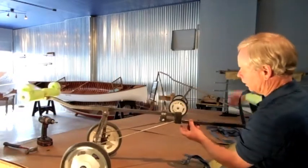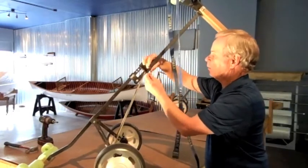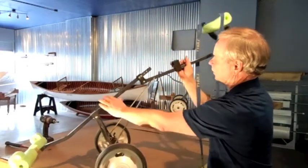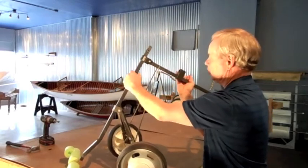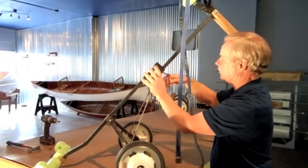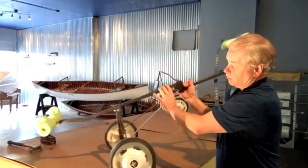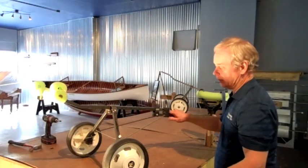Now, these nice carts are collapsible, and to make it so that you can collapse it, this piece moves up and then these will swing down and you have the cart folding up. But you need to be able to keep this piece in place. We've used a simple pin that we bought at a hardware store that will thread through there, and that will hold that piece in place. It may stay there without being pinned, but it gives you a little bit of added security by pinning it.